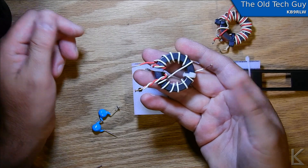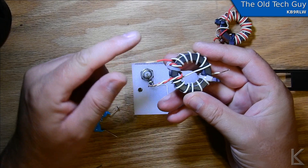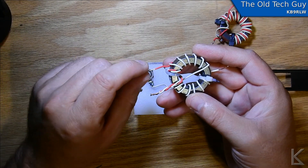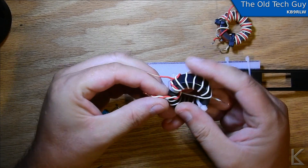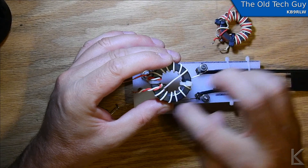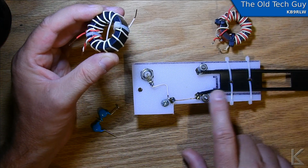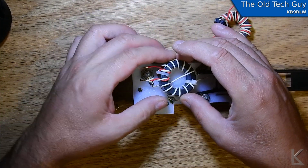There it is, all wound up. We've got the twisted wires — they come out here, this goes to ground. After two turns, the red comes out here and that goes to the center. So we've got two turns on the primary and 14 turns total for the secondary. This wire here will go to this terminal on the window line, and this wire of the window line is tied to ground.